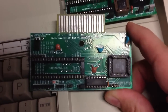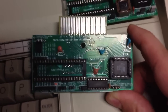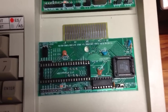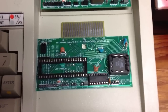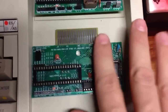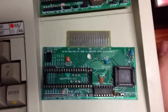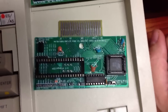With this cartridge we can emulate all kinds of nice, neat stuff. Besides the ROM stuff, we can burn previously unreleased cartridges like Plant Genetics to cartridge. Also cartridges like RXB that never existed in cartridge form — we can actually finally put them in cartridge form, because this Atmega right here will emulate the GROM, and then we can put whatever we want on the ROM. So we can do a lot of stuff we have not been able to do before since we have not had GROM emulation. And again, that's thanks to Mike or Terci.